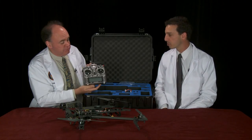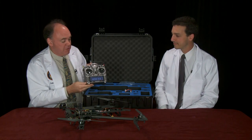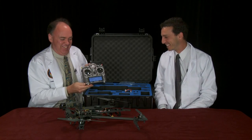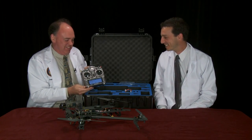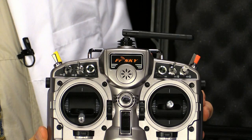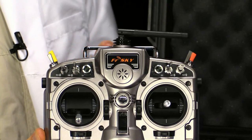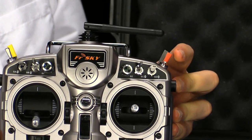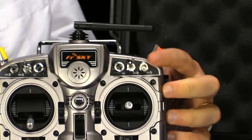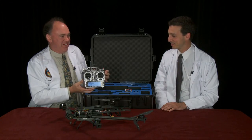The firmware that runs on it is open source, so there are always new features and developments the community is putting out. And it talks to you: 'Welcome to OpenTX.' She sounds kind of sultry — she doesn't like you! We can walk through what these different switches do, and they've got some of them color coded, which makes it easy to distinguish one from the other. The yellow switch is video mode selection between the GoPro and the board camera. The red switch is a failsafe selector. The white switch is mode selection for the flight control modes: GPS mode, attitude mode.